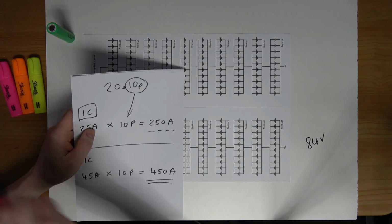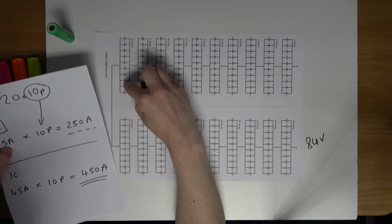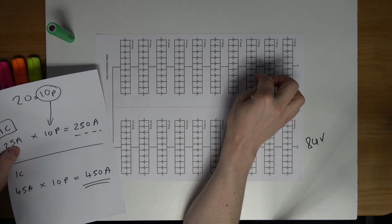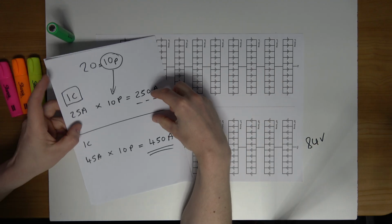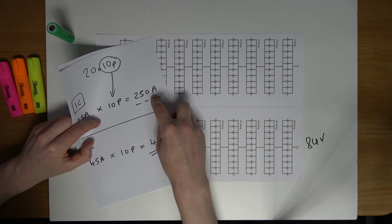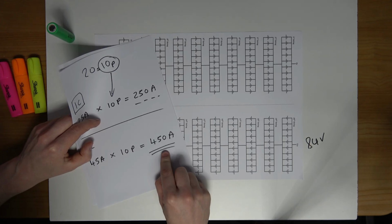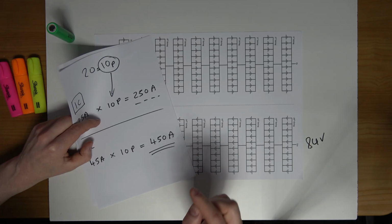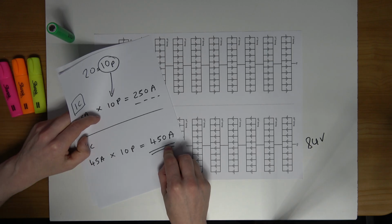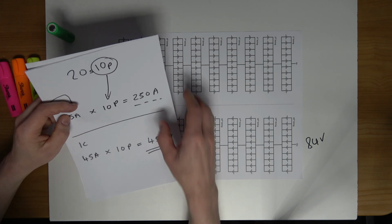So it's very important that I rate each one of the series connections between each one of the parallel branches to meet whatever I desire to pull from my pack. If it's 250 amps, if it's 450 amps, obviously it can't be any greater than 450 amps, but just to reiterate here, that 450 amps is only for short bursts with the temperature cut.